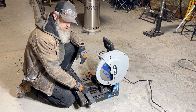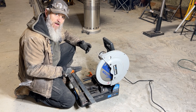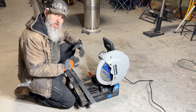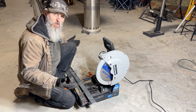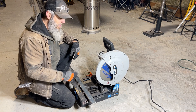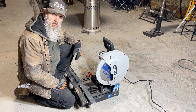The reason this system works for me with the flat bar versus bigger posts is because I already have 23 6x6 cedar posts supporting the roof of the covered porch all the way around front and back, so I don't need bigger posts. Each railing section is going to be around 12 feet or less, so I'll only have one or two of these vertical supports per section bolted in between those cedar posts. If I didn't have all those cedar posts, this would definitely have to be a different system.